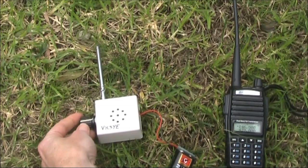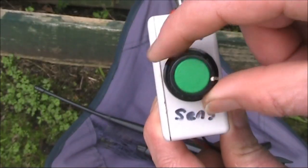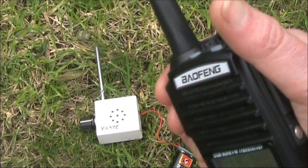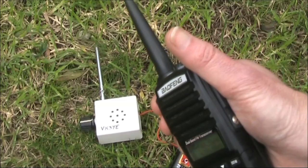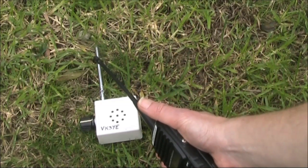You set the Screeky to the point just before it starts to oscillate — that's where it's most sensitive. You apply RF and it starts to make a noise. Go nearer and then it squeaks, going higher and higher with more and more RF.